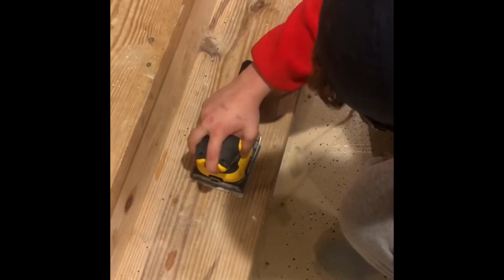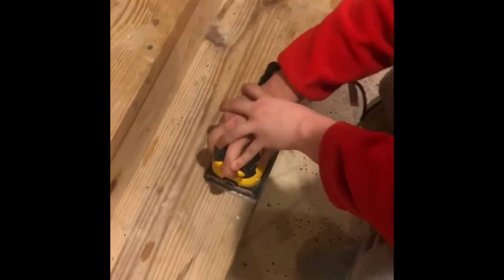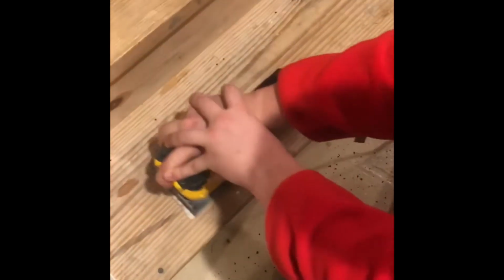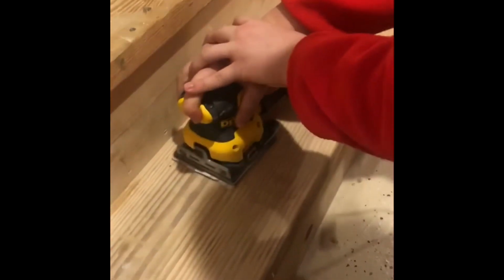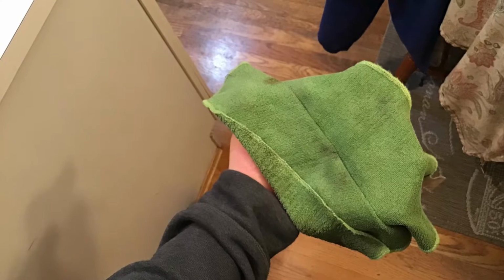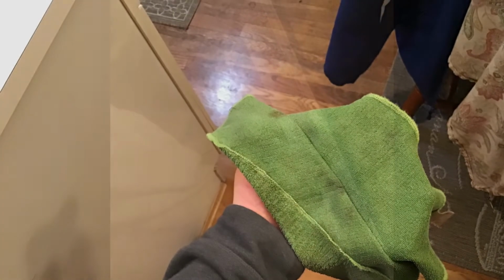After you have let the wood filler dry, you can start sanding. You will want to sand the spots with wood filler to make them even with the rest of the wood. Once those spots are sanded, make sure you remove any imperfections by sanding the edges of the wood or any splinters or knots you might see when looking at the stairs. After you sand, there will be a lot of sawdust. Make sure you get it all up with a wet rag.